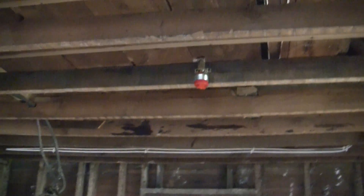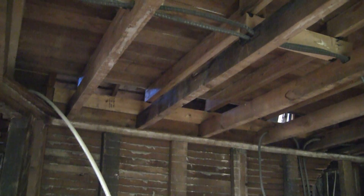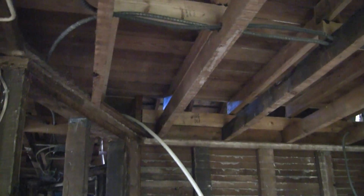The reason for my interest in putting in a residential fire protection system is that I had a house fire. I had always thought about residential fire sprinklers, but thinking about it and doing anything about it is not the same thing. But when all the studs are free and open for you to run pipe, I thought — why not do it now before all the plaster goes up? You simply take the PEX piping, straighten it out as much as you can, loop it through the ceiling stud voids, and cut it off where you need it. It's not that terribly difficult.